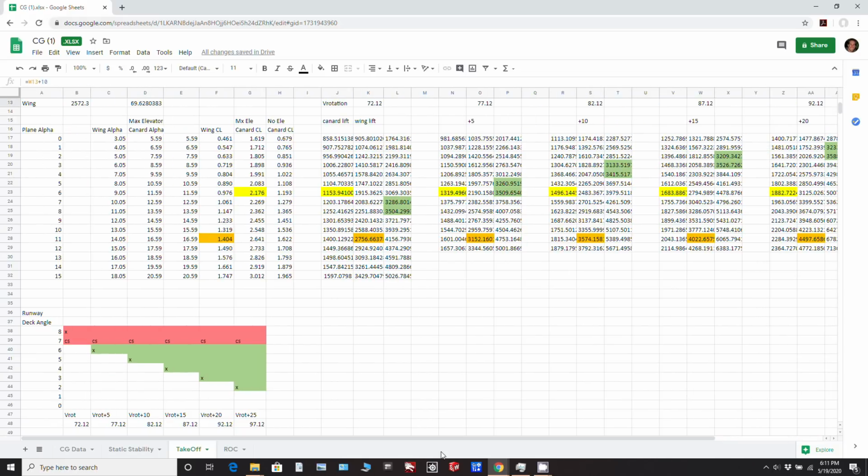And if you look at this little chart down here, he's got the different angles of attack. And if we go to the 97 mile an hour column here, that's the one we're going to use. And what it basically says there is, if we establish a 2-degree angle of attack on the aircraft, we'll be right here in the area where the aircraft will fly.